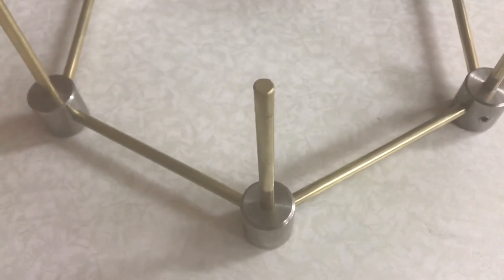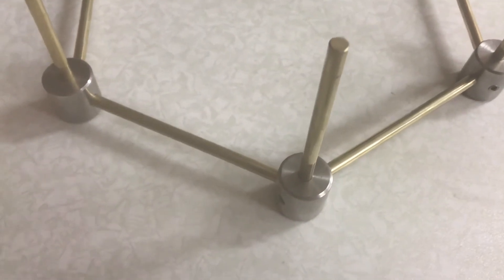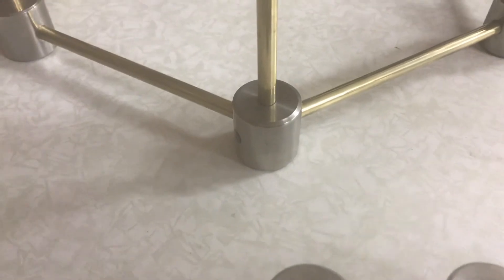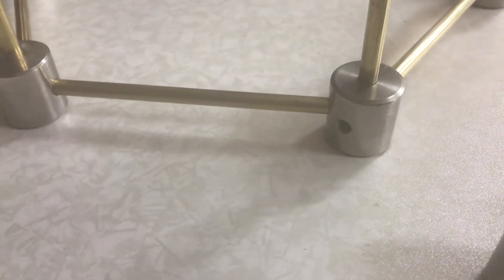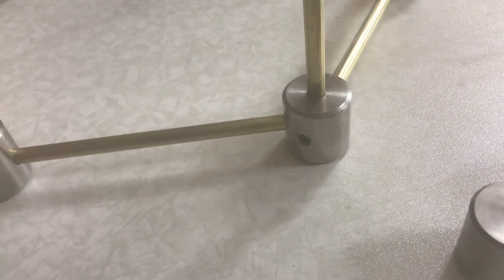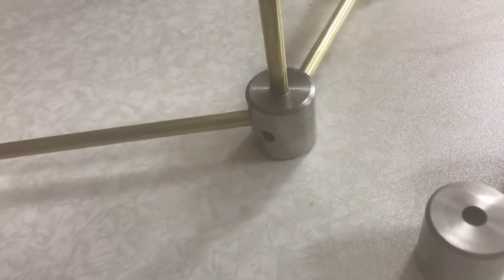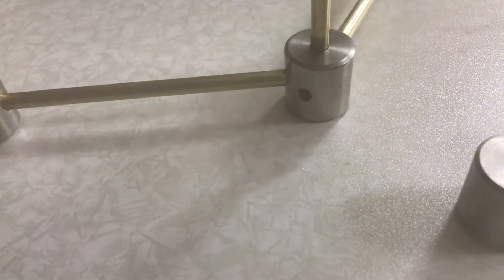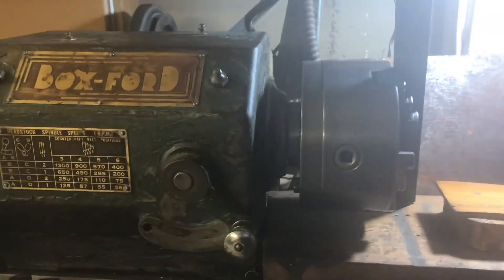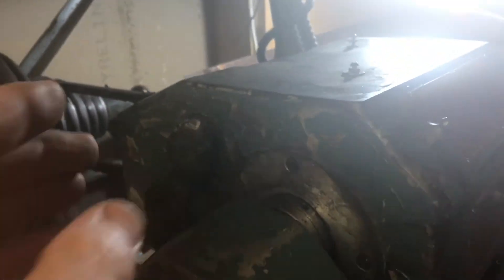...we need to make two more holes at an angle of 120 degrees, which was a little more tricky than I expected. We'll do that with a four-jaw chuck. This next part of the project is to mark and drill these two holes on the sides, and then we have to put in holes for grub screws. So now we have to remove the three-jaw self-centering chuck.